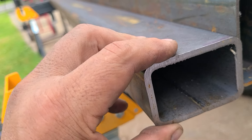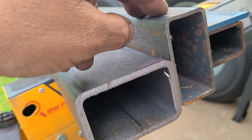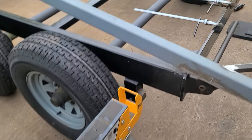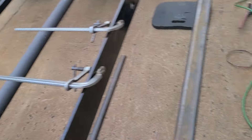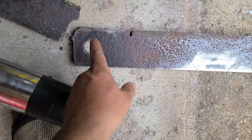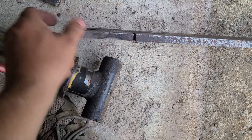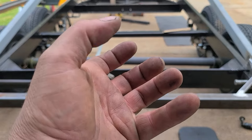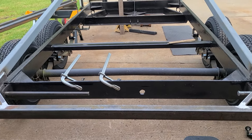I've got two more six-foot pieces of quarter wall - this will go where the ram goes up in, and the other pieces are just going to support the floor, which I think is a little more than an eighth inch. We'll have the two pieces in the middle where the ram goes, and then there are also these heavy pieces of steel - about half inch - that go in between the two pieces of quarter wall, so when it's pushing on the box it has to grab everything, not just bend one beam.